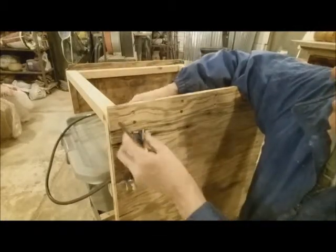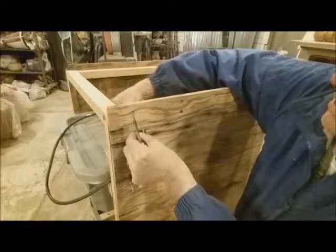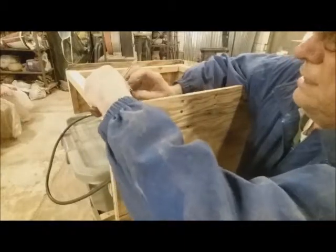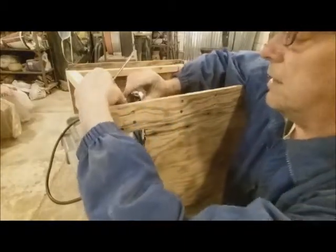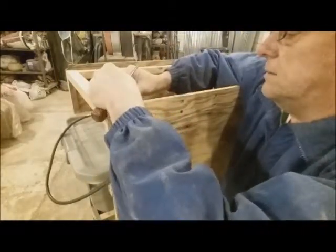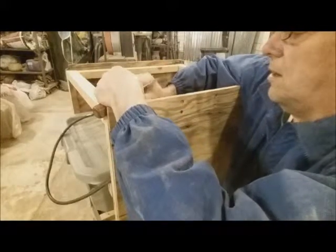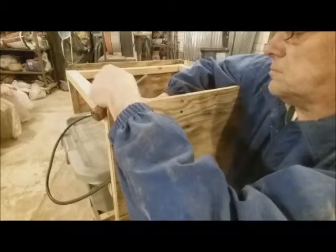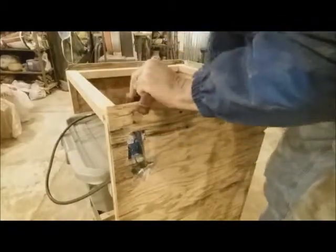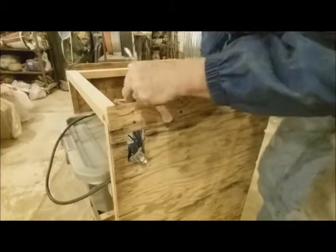Now the other side of the power cord, the white one in this case, is what I'm going to connect to the other side of the receptacle. I'm not sure that you could see all of this happening, but I'm wrapping it around again in the proper direction on the receptacle. And I don't have a long enough cord so you can see that well.